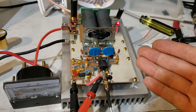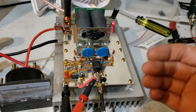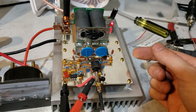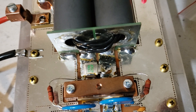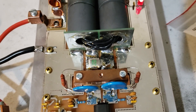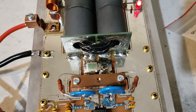Anyway, I'm back to it. I've made a couple changes since last time. This time I've got a metal mica capacitor right there across the drains, and I think that's what caused my issue last time — why it popped the chip.